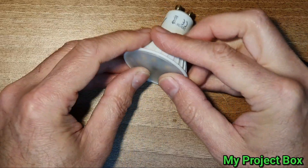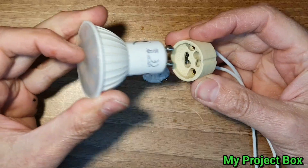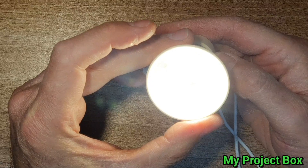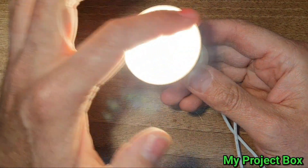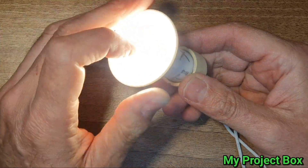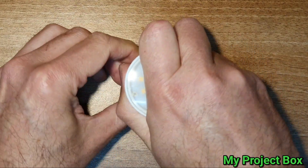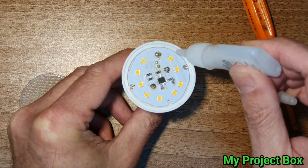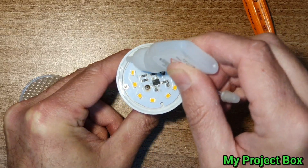Okay, I think that's one repaired LED lamp. Let's test it again. Here we go - one LED is linked out and I'm sure you'll hardly notice. One less thing to go into landfill. The only thing left to do is a drop of glue around the edge to make sure that diffuser lens doesn't fall out, because I think the original glue is not holding anymore. You can use anything really, but a contact glue is better because it's flexible. Though I think super glue is just fine.